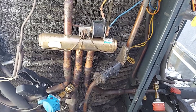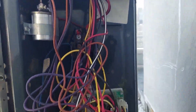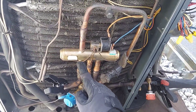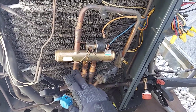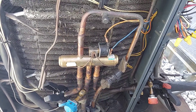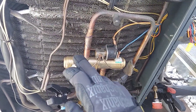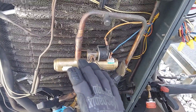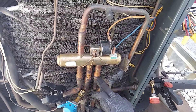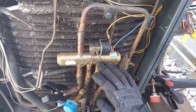If you have another method, share it in the comment section — I'd like to know. And if you like this video, if it helped you out, give it a thumbs up. I know this gives even the best mechanics a lot of trouble and frustration to replace these valves, especially if they're in a tight space. When you go to reinstall a new valve, make sure you put protection on the valve — use a wet rag or paste, or wrap it with a wet rag — so that the heat from the new braze doesn't travel up to the valve and destroy it. You can't just braze it without any protection.